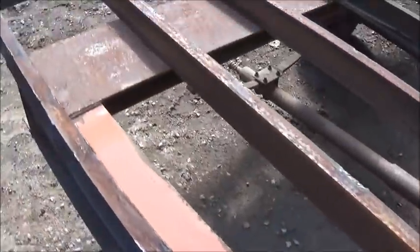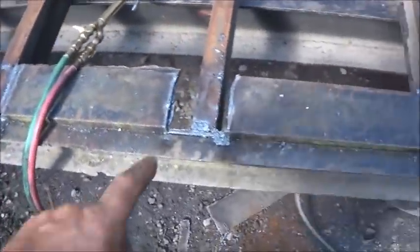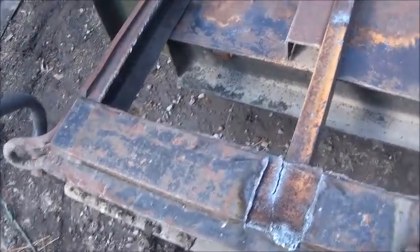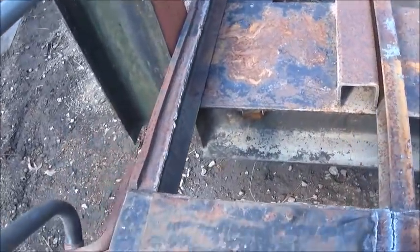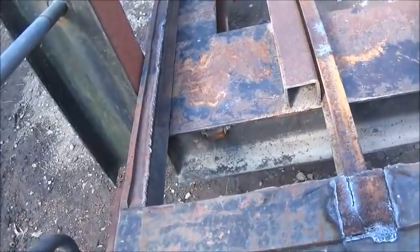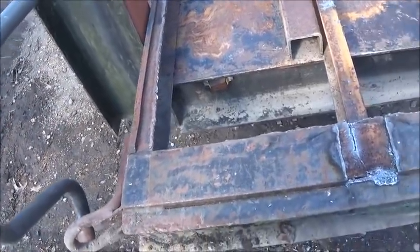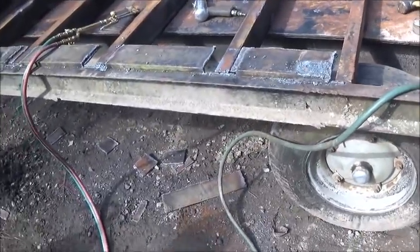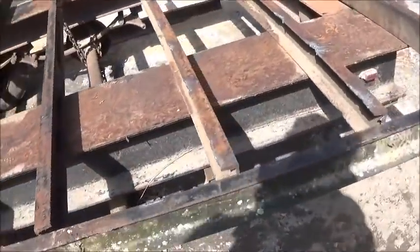Working away at it — we've just about got this side done. Having to carve it away, that's just the way it goes. Once I get the top carved off I can go down and cut the sides. I still have to clean up the lip here since this is actually the floor — I cut it lengthways down along the bars. I can take the air chisel and bend it up, as long as it's not welded across the bottom. Once this is off I'm going to go get the steel so I can start getting things cleaned up and get our sides on.